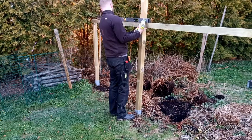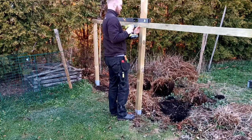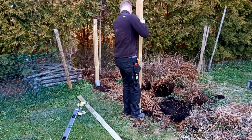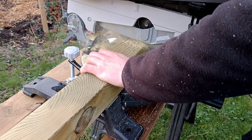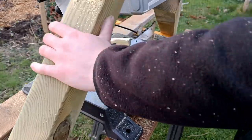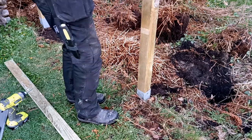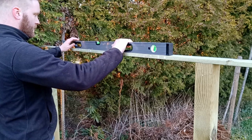This was not the easiest when working alone. I used some screws to keep everything in place when measuring and marking for the next cut, and as you can see it worked flawlessly. Then just take the fence post and cut it. I'm using a chop saw to make my cuts, but you can do this with a circular saw as well — you just gotta be more careful to get everything square and even.